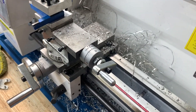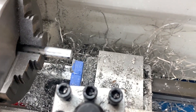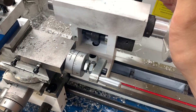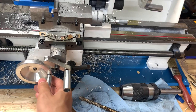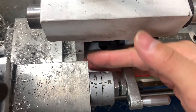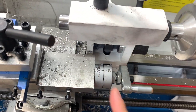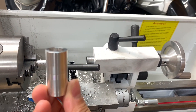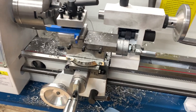I ended up just using my tailstock to hold the slide in place. I'd get near where I need my bit, leave a little gap, slide the tailstock all the way until it bumps the slide, lock it in place, then roll it back slightly to make sure any movement happens now and not while cutting. After that I do my facing, and it made a huge difference — the slide stopped moving and my parts came out completely flat. So, a good tip: use your tailstock to hold your slide in place.